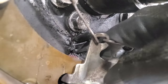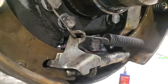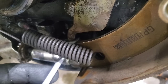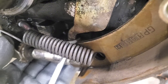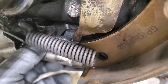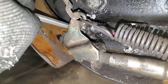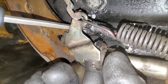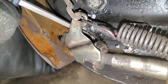Here we go with the other side — I got a little tighter camera view this time, just trying to show you how I route that in there and the way I kind of finesse it. That little stand I'm going underneath is actually where the cable rides, but it's so tight in there you can't really get it hooked well, so that's why I go underneath it. Once I get it up on that hook I will pry it in place so it can rest on that standoff where it's supposed to. I'm pointing to where that's supposed to ride — it keeps everything out of the way as you're functioning your brakes so it doesn't get hooked on anything. Here we go again with the e-clip — it's kind of a two-handed operation but it's really hard reaching up in there. I've tried everything from pliers to screwdrivers to pry bars, and really the best way is if you can get your finger in there to hold it in place and use a little screwdriver to pop it in.